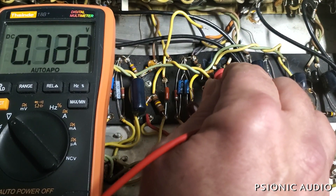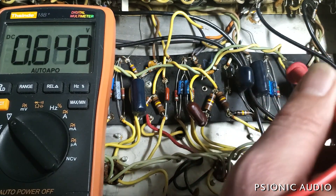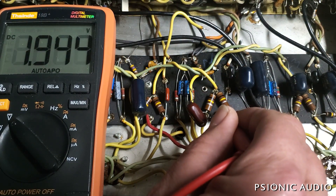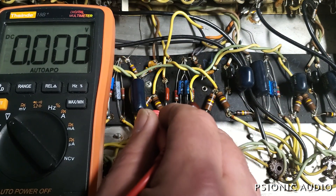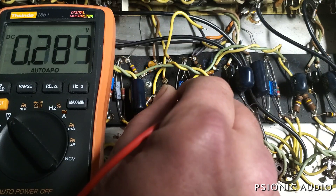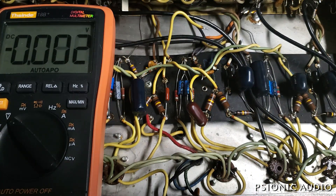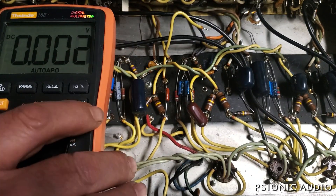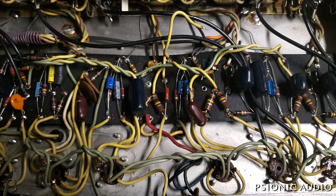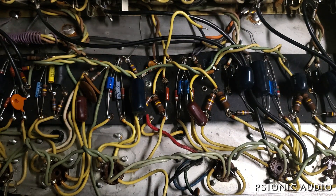Over here by this treble cap on the board, I've got a volt. Over here where the normal channel comes out, I've got a volt. By this bass cap, I've got a quarter of a volt. Two volts here. So I need to do a lot more cleaning, because you never want to have any voltage — let alone the six or seven volts I was getting — in what's supposed to be your insulator. Let me report back after I do some more work, but if I show every step in this it will be a three-hour video.